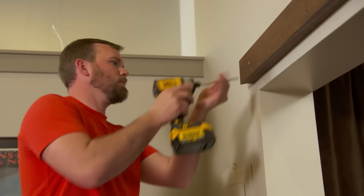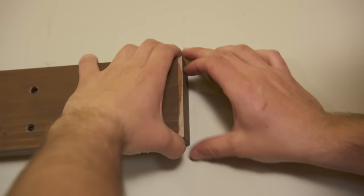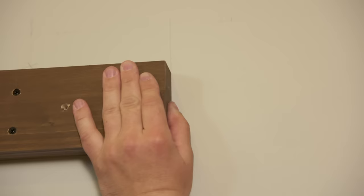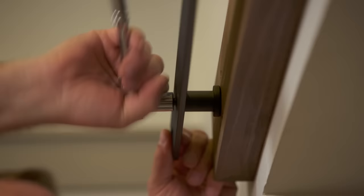This mounting board attaches to our build-out with screws. I've left the board long and mitered the ends — we can add a mitered return piece on the corners for a finished look. I want to pre-drill before setting the trim nails so I don't split the wood. Then we tighten up the lag screws with a socket wrench, setting them all loosely first and then cinching them up at the end.